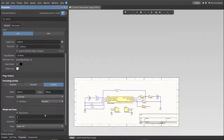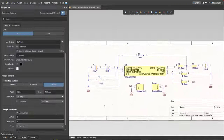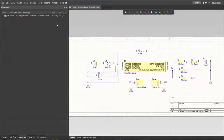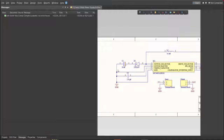This is the finished schematic. Before we go to placement, make sure to always perform validation — right-click on the project PCB file and click Validate. To check the result, go to the Messages panel. As you can see, no errors were found, so now we can perform the Engineering Change Order.